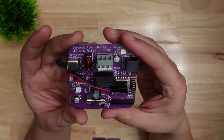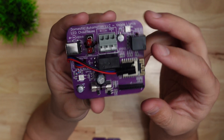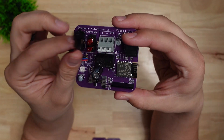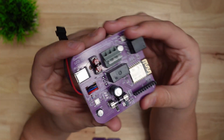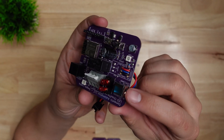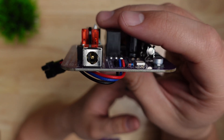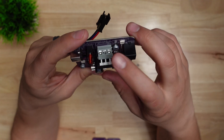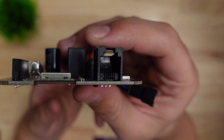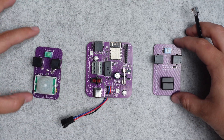The Domestic Automation Controller looks kind of complex but it's pretty simple and just gives you some modular features. It has an LED strip connector built right into it so it could easily supply a strip without any soldering, which is really nice for plug-and-play beginners. It has a barrel jack for 5 volts DC input only — no 24 volt or 12 volt. It has a set of output terminals if you want to power something else, and it also has an RJ12 jack which you can use to expand the functionality of the device.